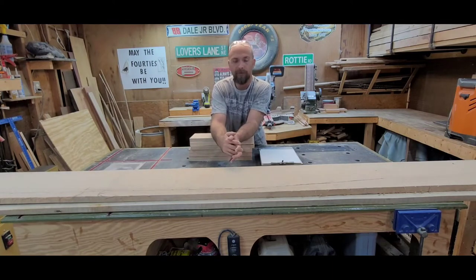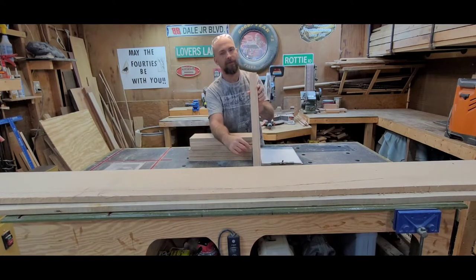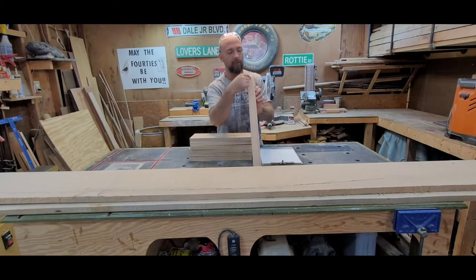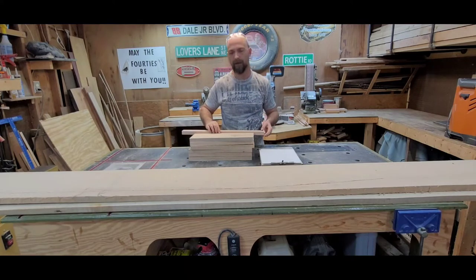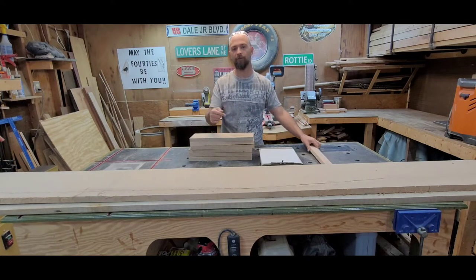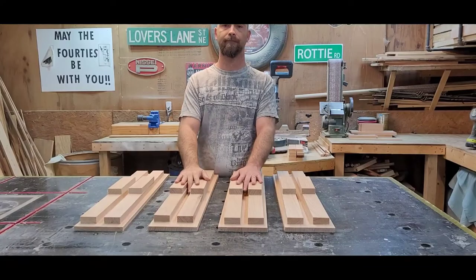What's left over we'll start working the two-inch pieces out of. We'll cut a dado out and then lay it nicely over top - it'll leave a little reveal on the front and the back shall be flush. That way we can glue and screw it to our drawers and make a nice pretty door front. I'm gonna save you all the milling of this wood with some editing magic.